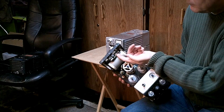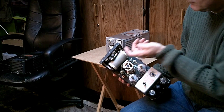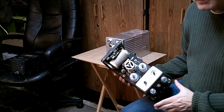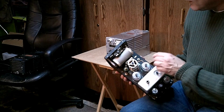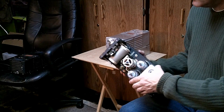This is the antenna relay — transmit and receive. The receive condition grounds the output of the transmitter, which is interesting. Apparently they didn't want any RF coming out of this thing, so they ground the output when you're in receive mode.